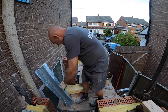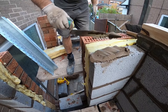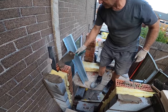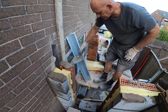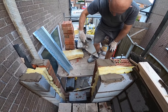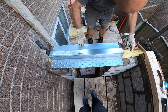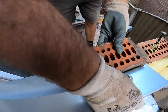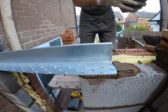I'm going to bed this on. Don't need a massive bed — if you put a massive bed on, then you won't work with a bed on top of the lintel. Put the mortar on the bricks last because it goes off very quick. Just a smidge — just enough to keep the lintel back to the brickwork. Put that blockwork over.